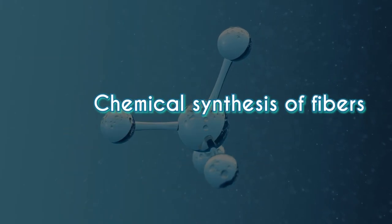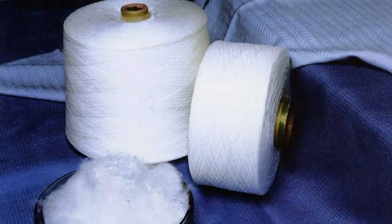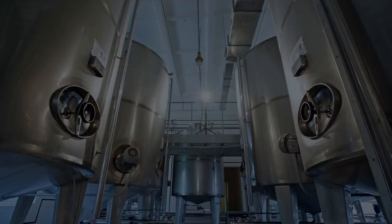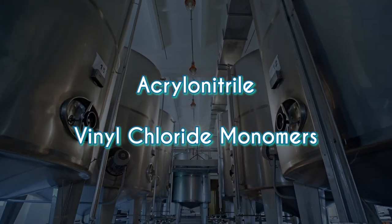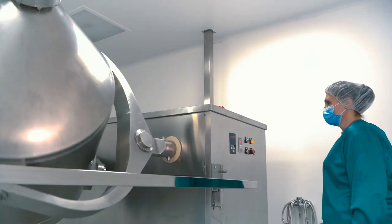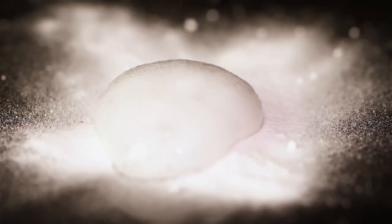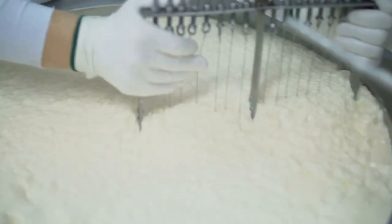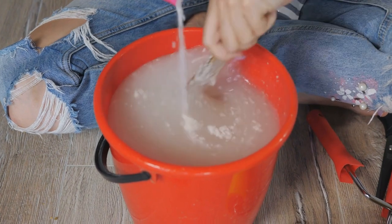The process of making fake fur starts with the chemical synthesis of synthetic fibers. Although different types of polymers can be used, mod acrylic polymers are a common choice for their ability to closely mimic the appearance and texture of real fur. The process begins with mixing acrylonitrile and vinyl chloride monomers in a stainless steel container. The mixture is then subjected to high temperature and pressure in a chamber with mixing blades in motion, initiating the polymerization process. The result is a white powdery resin that is dissolved in acetone to create a thick liquid. Next, the liquid polymer mixture is pumped through a filter to remove any undissolved particles, before being extruded through spinnerets submerged in a water bath.